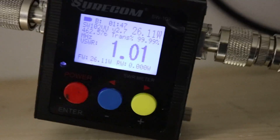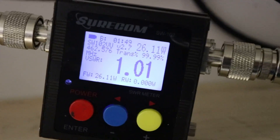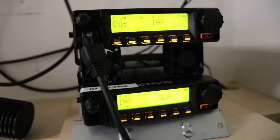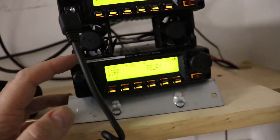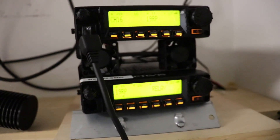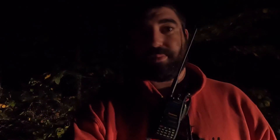I don't know about you, but that's a far cry from the 40 watts they were promising. This is how I've got it set up — I've got two fans in here for cooling, and I've tested both radios. They're both identical in their wattage output. We're about eight miles from the repeater. I've got this microphone here hooked up to my KG935G. We've got the radio on high power and we're going to test and see if we can hit the repeater.